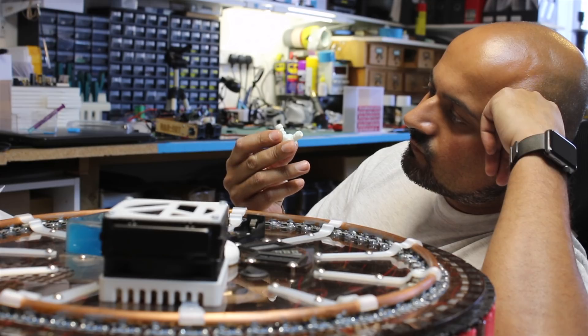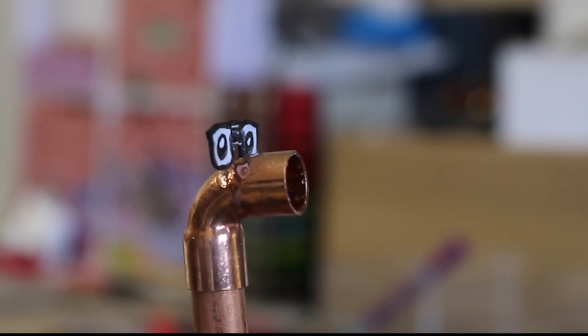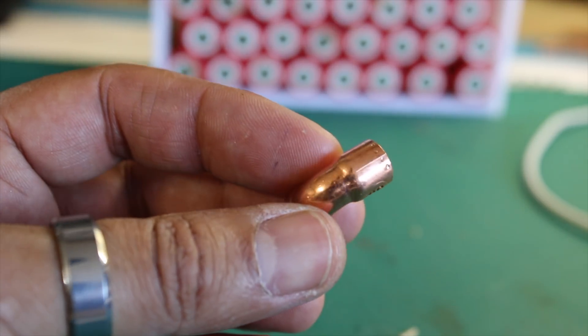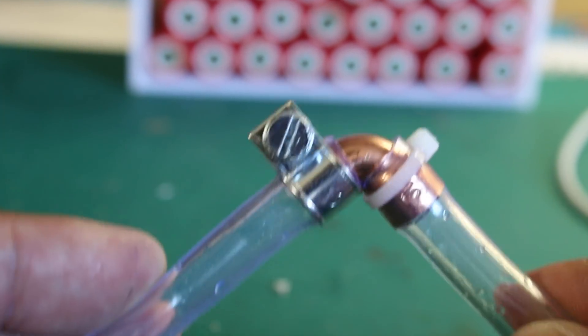Weeks were spent, and even after the BFC had been fully assembled and was being tested for a few weeks, I noticed coolant collecting at the bottom. After much soul searching, the solution had been staring me in the face the whole time: 8mm copper elbow fittings that fit very nicely into 8mm ID silicone tube and can be tie-wrapped or used with jubilee clips, like I did.